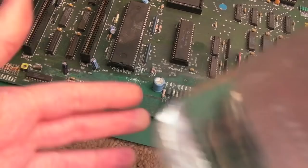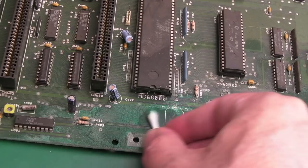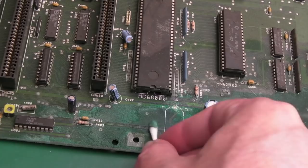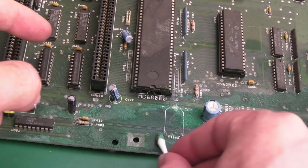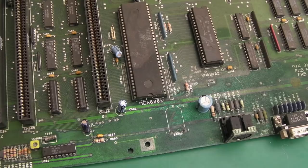We'll go at this now with some white distilled vinegar. I'm just curious to see what happens to the surface. We might be lucky, because it looks like it's just lifting off the solder mask — the solder mask is the thing that's been eaten into, rather than the actual connections. You can see two traces there that are largely okay, a bit corroded here and there, but I think this one might need less work than the previous board.